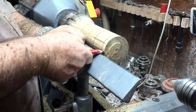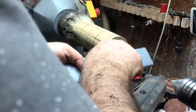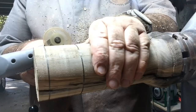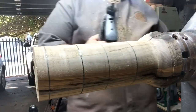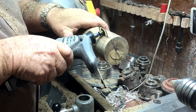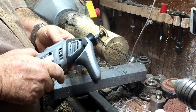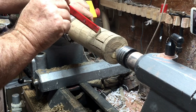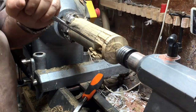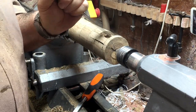I'm creating the markings for an idea I've got — I'm going to cut out a few pieces from this flute and fill them with resin. I'm cutting two grooves into the wood and two diagonal grooves. Those grooves are made on the bandsaw, and now I'm going to chisel out this piece of wood so it will be replaced later with resin.